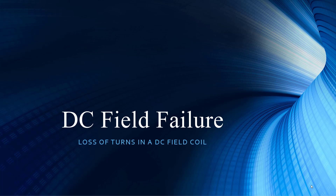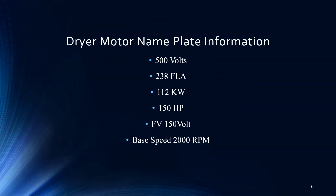So this motor — here's the nameplate for it. Anything stand out to you right now, Noah? Something worth mentioning is you're dealing with a different field voltage. A lot of times there's a differential voltage to the armature versus the field, and that's something to be aware of. A lot of times you're using field voltage to adjust the speed control of the DC motor. In this situation, base speed of 2000 RPM tells us that at full field voltage, that's the speed you expect at full load.